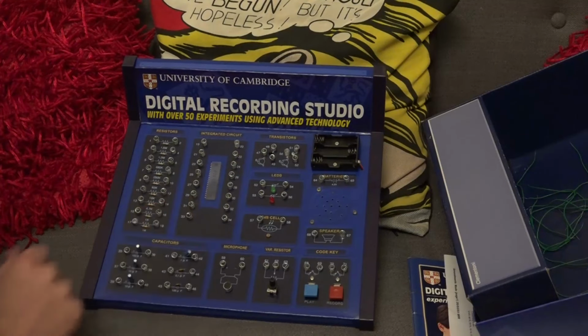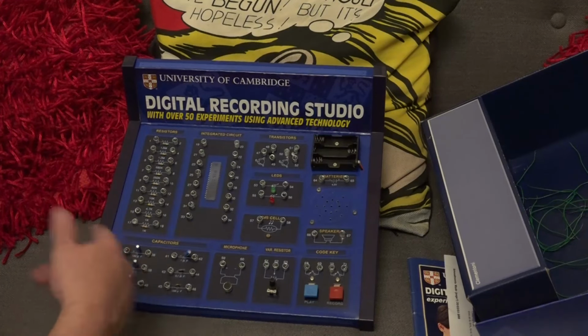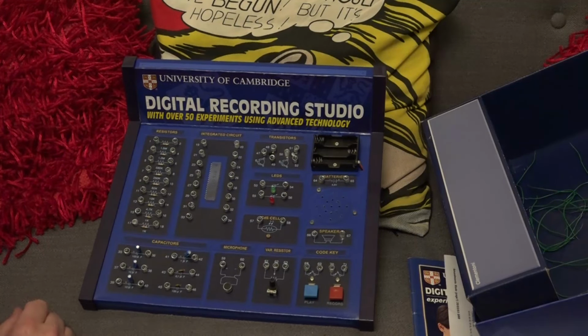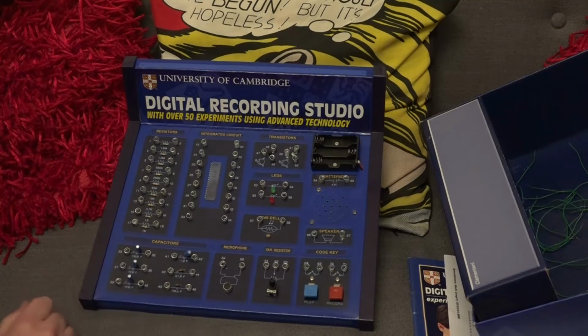And then we've got this integrated circuit which says RTS0073. Now, that chip is a sample and hold sort of audio recording chip. It's the kind of thing that would probably have been in things like electronic toys, where you have something recorded and it would just continuously play it back. One of my colleagues actually built a little box with one of those chips in it, used for testing line circuits of microphone cables. You'd record a message on the other end, saying this is channel 32 testing cable, and it would just loop that so that when you get to the other end and you're listening to it, you know which one it is.